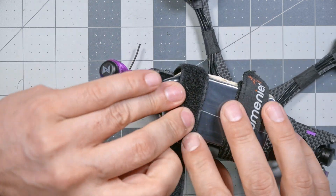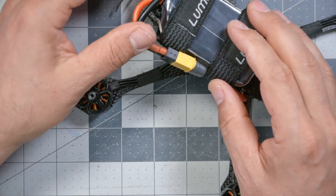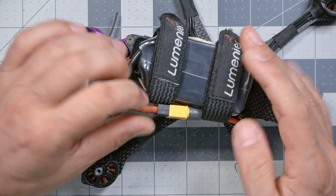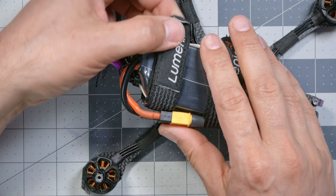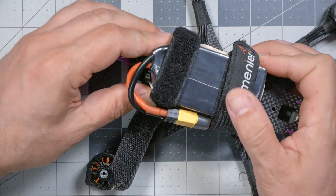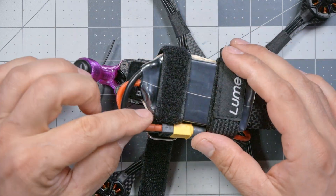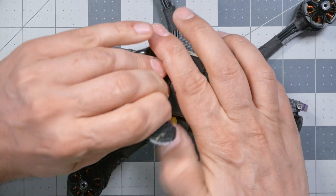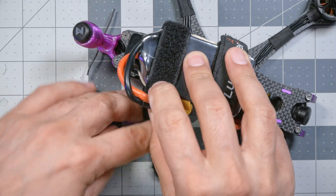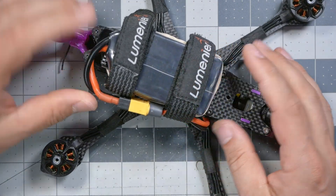I probably don't even need to strap it here — it's probably going to be fine. I can cinch this down, plug this in, and now where is it going to go? It's not going anywhere — it is good and restrained. When you restrain the battery strap, it is important that you give it a little bit of room to move. In flight the battery could shift forward and backward slightly. If you tighten down on the main battery strap so much that it has no room to move, then if the battery shifts, it could unplug. So you want to make sure it's got a little bit of give — but not so much that it can get into the props. Just tucking this front one in is going to be just about perfect.